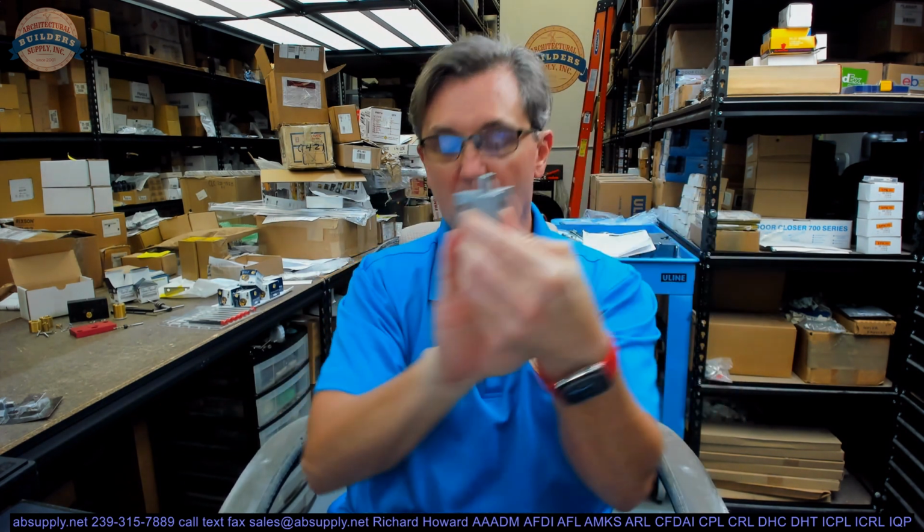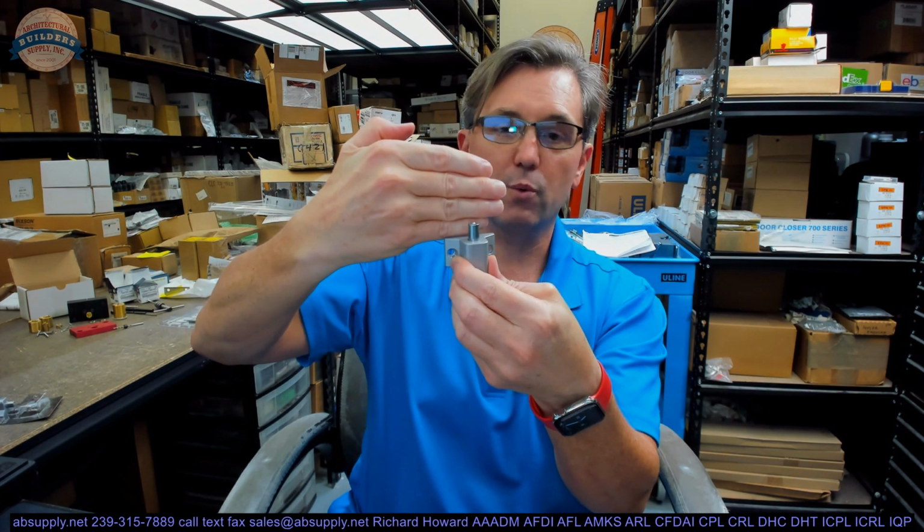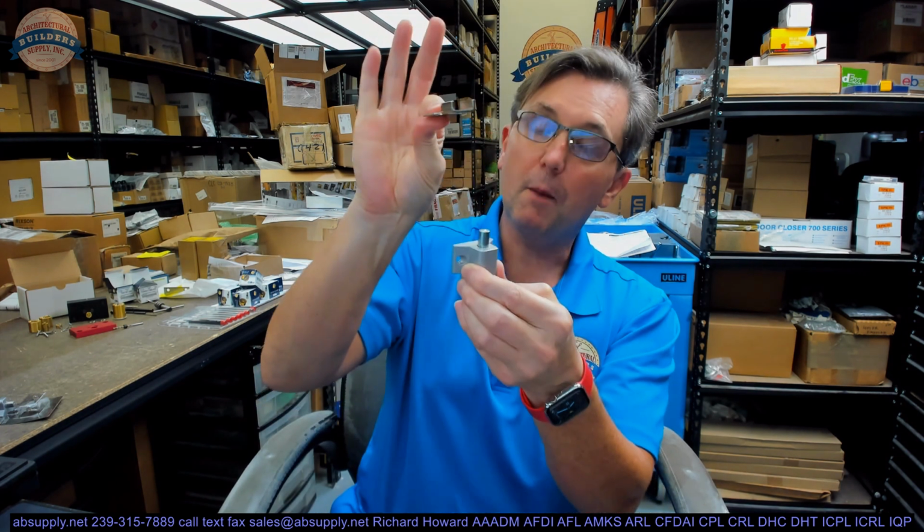A rim application where the body is mounted on the perimeter of the door or whatever you're attaching it to, and you need that strike to hang off. So it would be more like an application in the factory's image. They're showing it on the door that is set to the outside. Well, if you were putting this on the door set to the inside, if you follow along, you could slap this to the top of the door. So it's on the top of the door and it slides like this. Well, the header is right here, the casing is right here, and you can't drill into the edge of the casing for this. So you'd get that plate up onto the underside of the header, and that's how that would work. So this would be like when the door is biased towards the inside.